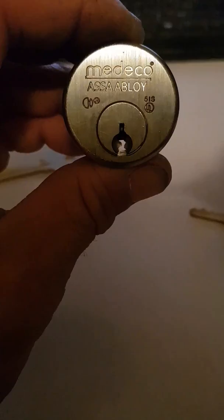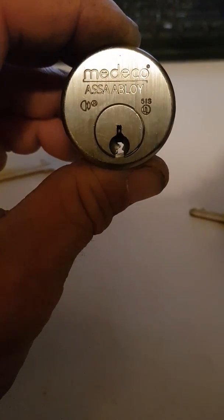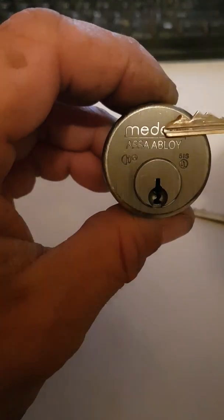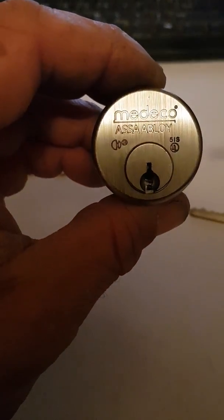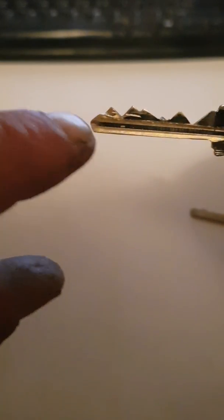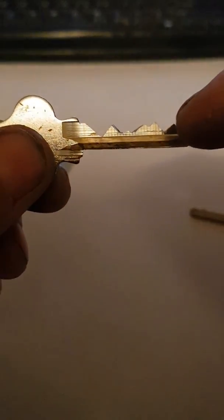It was just a little trial and error process. I took the Medeco lock apart, placed the pins aside, put the sidebar aside, and had just the naked core. And then I removed material bit by bit from the inside of this profile line, both top and bottom, and I worked the top and bottom of the other side as well.